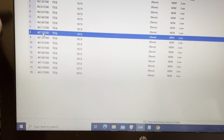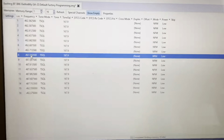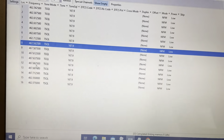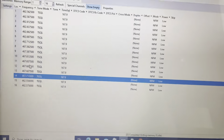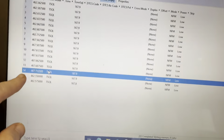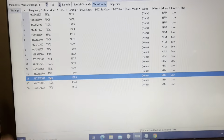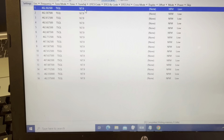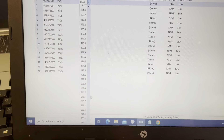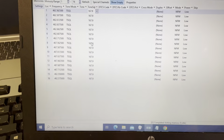If you don't have a GMRS license, you can reorder these frequencies in any order you like. The most popular channels are 1 through 7 and 15 through 22, which means channels 8 through 14 are less likely to have activity on them. You could make FRS 14 channel 1 on your fleet of radios, then use a non-default out-of-the-box tone, and you shouldn't have an issue.